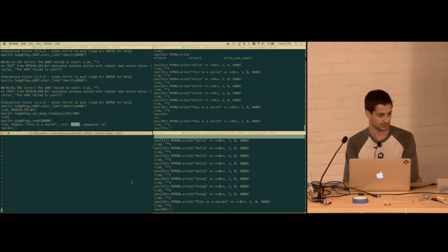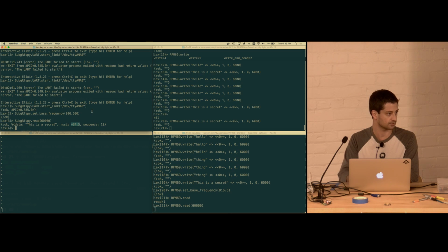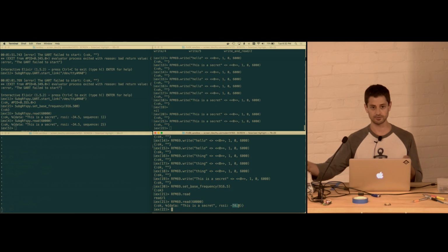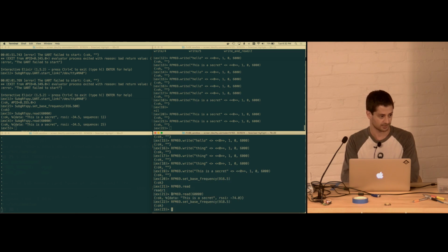These two, if you notice, didn't do anything. They're not actually listening on the same frequency. So if I were to tell this chip to set its base frequency also to 916.5, and then I told it to listen, it uses the same basic contract. So I'll do that, and I'll do that, and then, yeah. That's pretty bad for some reason. I don't really know why that's happening. All right, so you can see how setting the same frequency, you get the same packet structure and modulation and everything. You can communicate across these chips, and they can get pretty far apart. But if you've got them on different base frequencies, obviously they're not going to talk to each other.